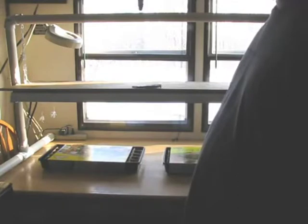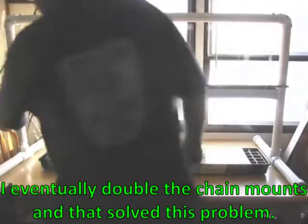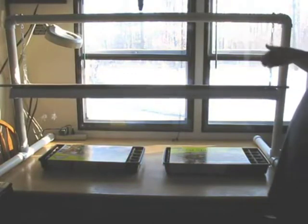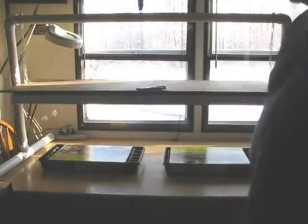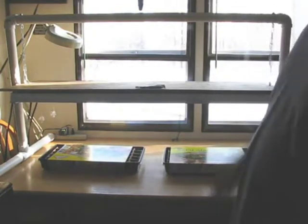As I explained later in the video, you see this little counterweight here — because I'm pivoting off these two eye bolts, and with cords hanging here, depending on where the cords are plugged in, it'll pull to one side. All my cords go off towards the back where the outlet strip is, and these are going to be on timers, so of course it's going to pull it off-balance. What I do is just put something here as a counterweight, and it levels it right off. I'm also going to tie the cords up with tie straps so they'll be loose and can move up and down.